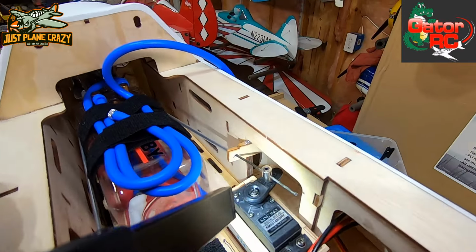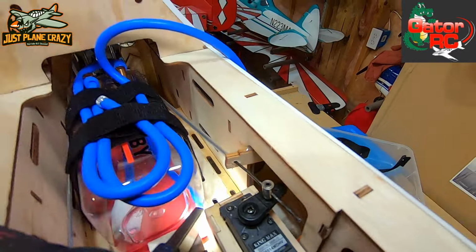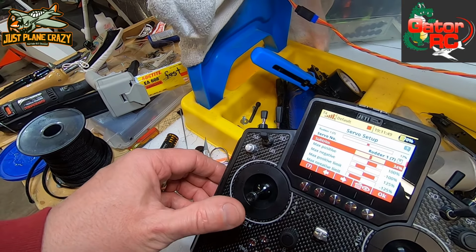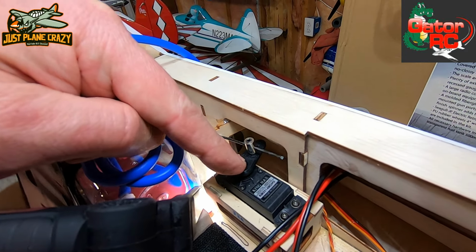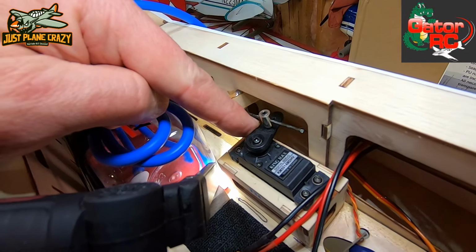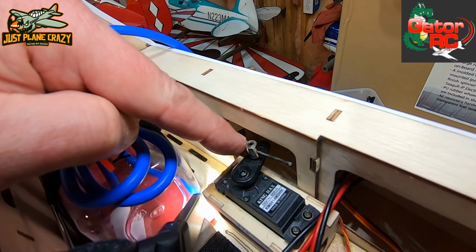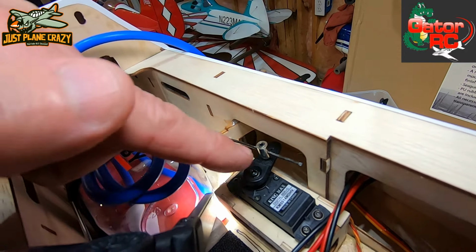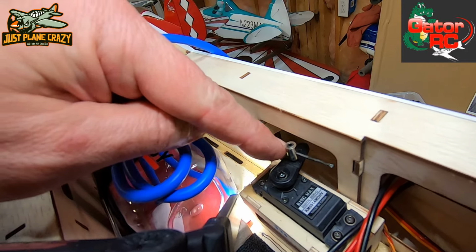All you simply have to do is watch your choke on the inside and see what it does. I'm trying to set up this throttle servo right now. What you want is the biggest resolution possible, because you want to actually feel the steps of the throttle going all the way up and down. You don't want to go just 2 clicks and have it go from idle to wide open throttle, and that's what happens when you don't maximize the resolution coming out of these servos. On the throttle, I'm only using a 5514. I don't need as much torque as the 5523s, but with this I might have to go a hole out from the inside hole to maximize, because I think I'm a little short in the throw, and you don't want to set the servo arm so it's coming all the way on the backside. I want to set my throttle up first, and then I'm going to set the choke up so the choke's open or closed. And here's how you can cheat also with your throttle.